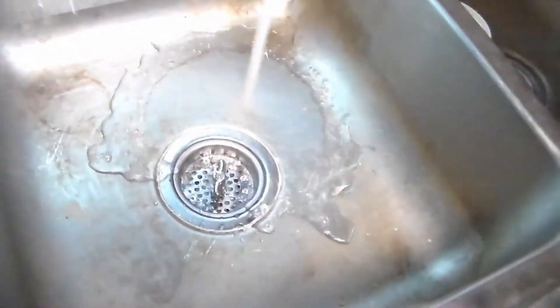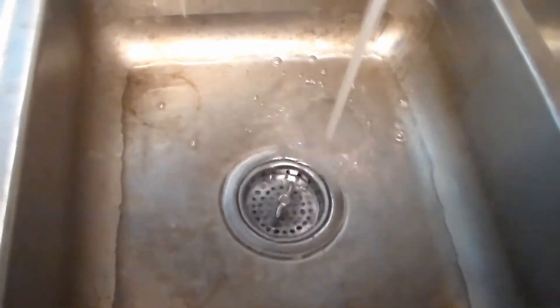I'm going to go ahead and fill our sink up. Also, it'll be highly beneficial to take a paper towel and dry anything up — especially if you had water leak prior — so it'll be easy to detect a new leak. We can just run our hands around the pipes and see if there's any moisture.